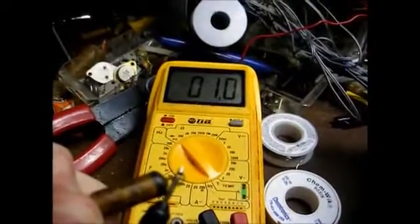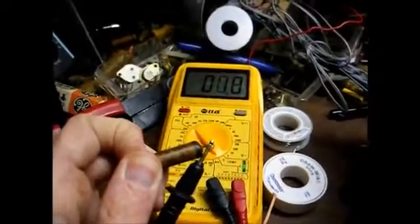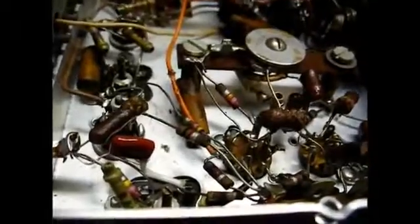So let's unsolder one end of it and test it. Okay, there's one end of our capacitor cut loose. Let's check and see what we have now on the meter. We have infinite resistance. Now let's check at the capacitor. Come on, get on here. And look at that. This capacitor is dead shorted. Here's our capacitor out of circuit, reading dead shorted. Let's see what value this thing is, and hopefully I have one. Here's our capacitor replaced, a 0.01 microfarad. And look on the meter. No short.